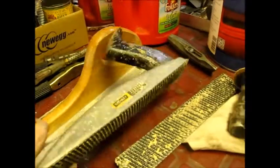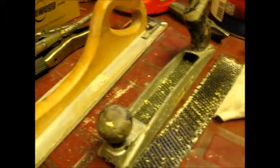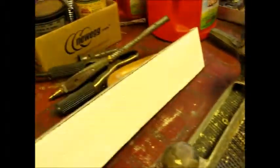So we just have one more coat, I believe, to put on. It should be maybe one more coat. And I went from 40 grit on the flat board, now I'm going to be into 80. And here's a couple of tools that I used again. This was in the early part of the drying period, first pass, if you want to get off the snots. Excellent old tool to use. 40 grit on a long board by hand for this.